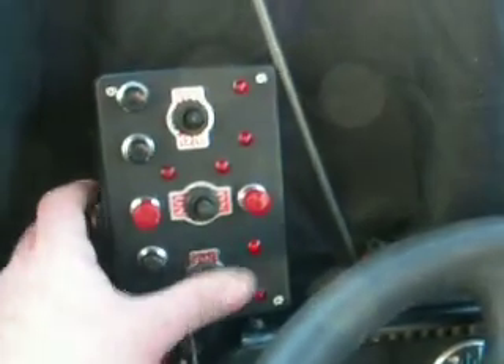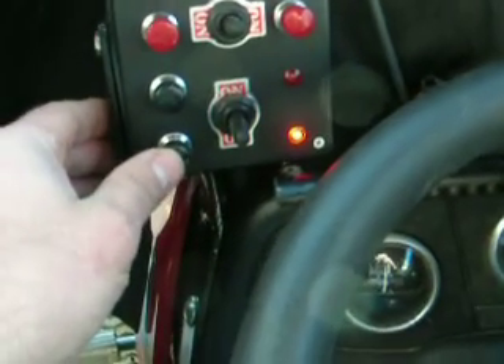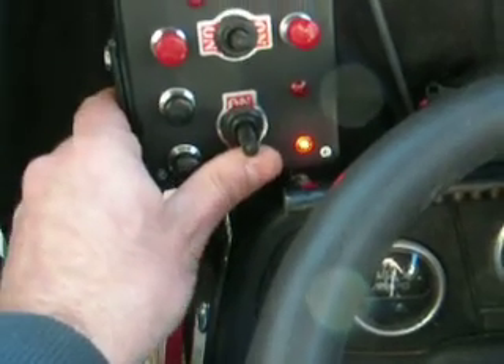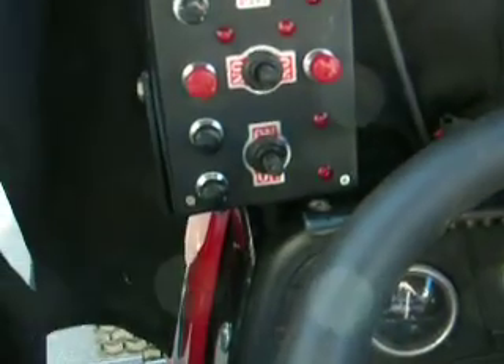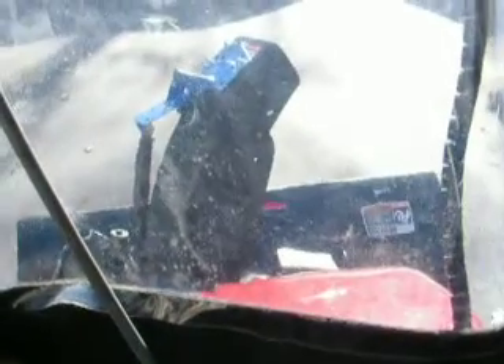Here's how it works: the snow blower is already up, in the middle neutral position. I want it to go down — so now it's going down. It's fast. It stays down, and at the same time I have disabled all the other switches in this mode so there is no short circuiting, because the polarity of the actuator needs to be flipped in order to make it go. This is the angle — right there. That windshield wiper motor has been there for a couple of years and it works quite nicely.